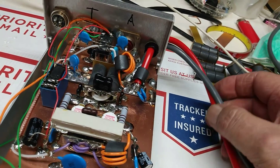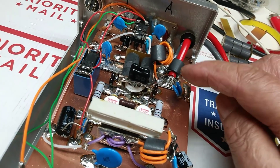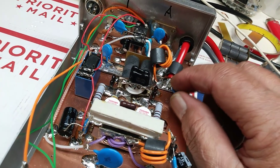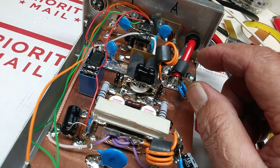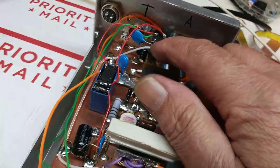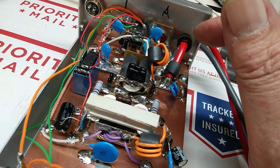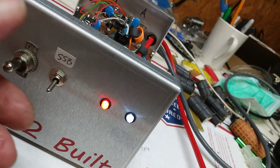Anyway, like I said, I put a relay in there for your bias. I upgraded your power wires to number eight. I put a bus bar in here and some 103 caps because the RF was actually shutting down the meter in my power supply — so that's taken care of. I changed your relay key circuit. Got both lights working, the single sideband delay still works fine.